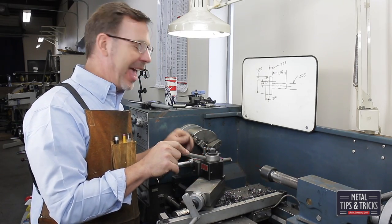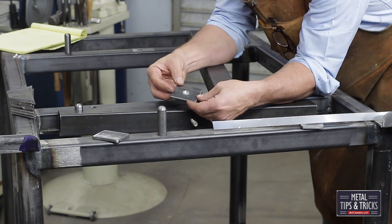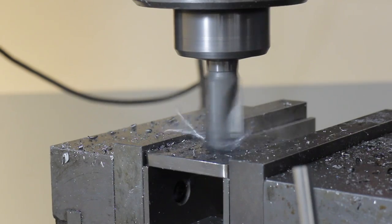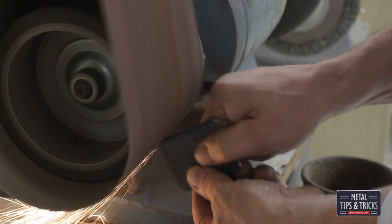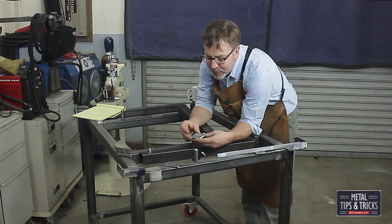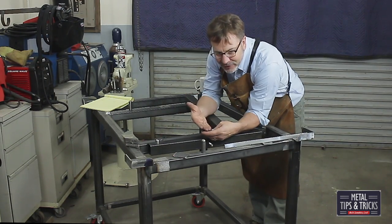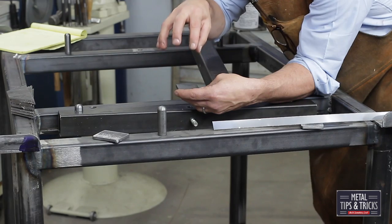The shaft here is three-quarter inch. When I set up for these plates it's kind of the same concept, except this is a three-quarter inch hole that's been dished out with a radius bit. Radius bits do not drill in the center very well — the forces just aren't right, so you want to drill that out first. You can see we just cut these up on the band saw really quick and easy, took off all the edges, and also did a radius on each corner to smooth them out. When we're done we'll have cork over the top of these, up against the surface plate, because we don't want steel against the granite — the slide potential is really high and hard material against hard material is never favorable. Something is going to have to give.